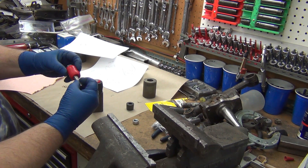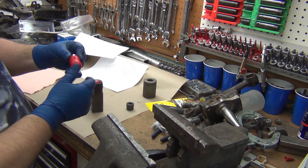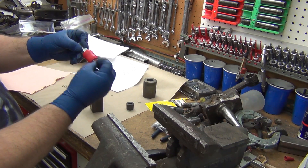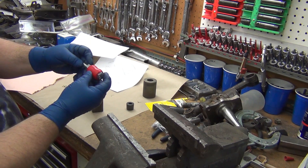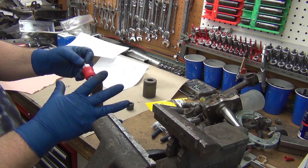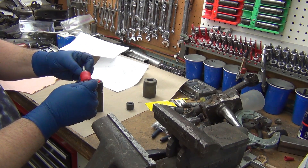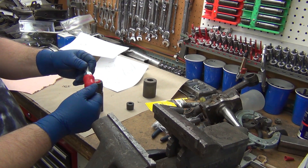Something like a bolt that'll hold it away from the chuck and put just a little squish on it. I don't really want it to squeeze the inside out, so I'm hoping just a little bit of pressure will be enough to make it grab. I'll probably have to take some light cuts. I've got a sharp cutter — turns out it's not high speed steel, it's a carbide insert for aluminum, so we'll give that a try.